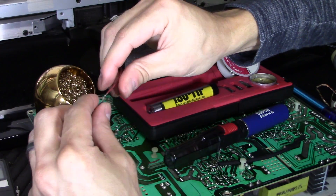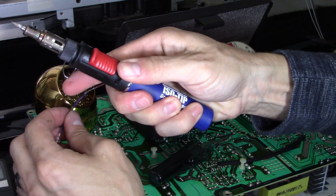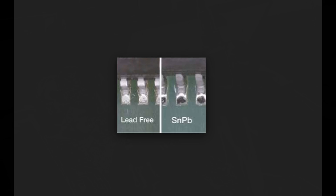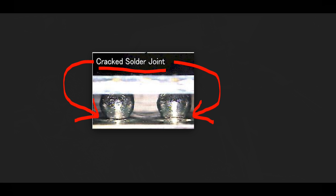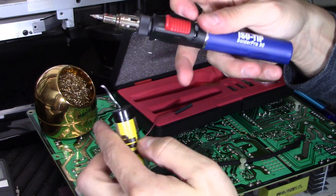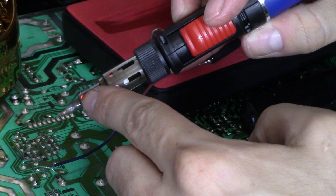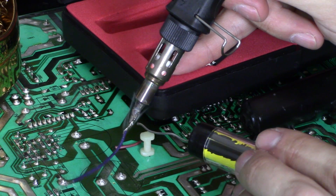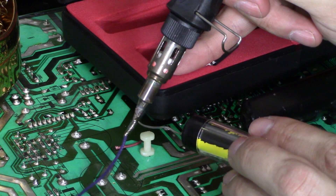Just like that. Then go ahead and turn on the soldering iron. Now, you want to use solder with lead in it. The reason you should use lead solder versus lead-free solder is because you get a better solder connection. Lead-free solder causes cracks; lead solder lasts longer. The lead is fine as long as you don't inhale the fumes from the solder. You want to wash your hands afterwards. Make sure that vent is facing upward, heat that up, and then when the wire is heated up, apply the solder and go back and forth.